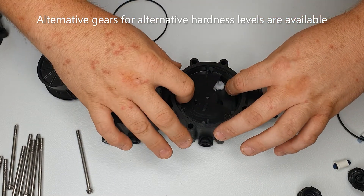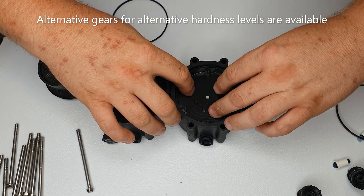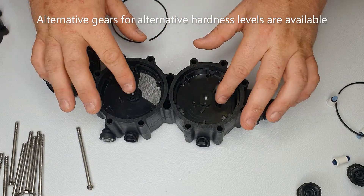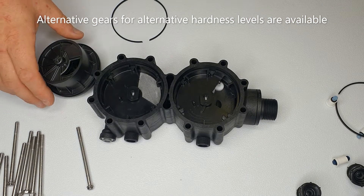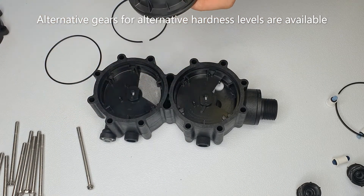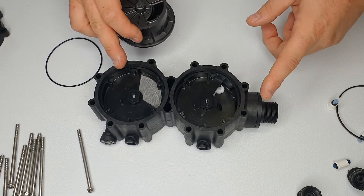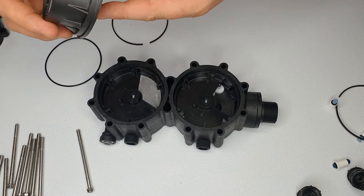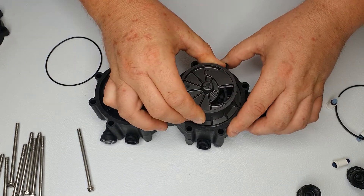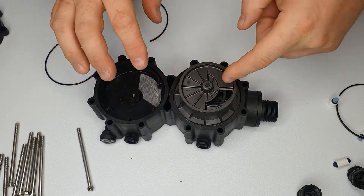This can only sit one way and it is quite fiddly to get it in. It will click into position. Put your paddle on and keep it in the 12 o'clock position. Now let's put the meters in next. Installing the meter — make sure you're still on the left hand side for the outlet. Get the meter and alter the paddle to the three or nine o'clock position, then gently push it into position until it clicks in. The teardrop orifice here should be to the left.